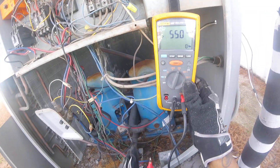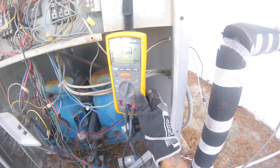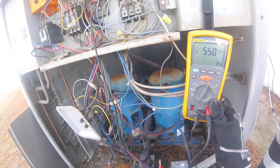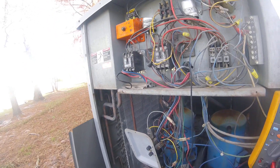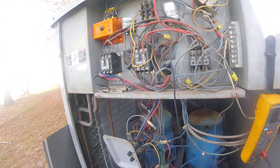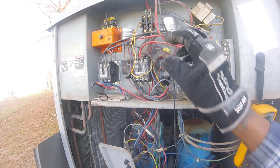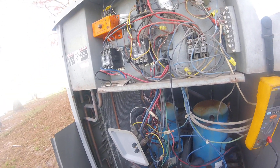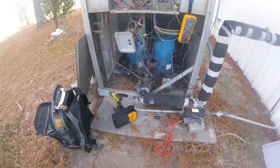As far as the wiring, it's not grounded. Mechanically it could be messed up — I don't know why the leads were off, I don't know what the tech before me did. But I'm going to check the pressure, look into it. I'll change the contactor on this one right here — this other one looks good, I don't think I'm going to change that. So I'm going to change the contactor on this one, clean these wires up, check my pressure, make sure I got some refrigerant in it, and fire it up — see what it do. Maybe I'll make a video on me doing that. Thanks guys!